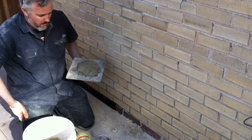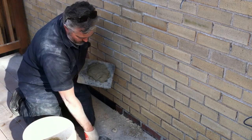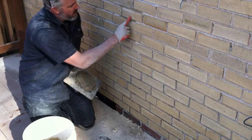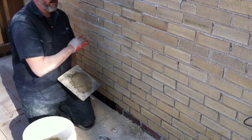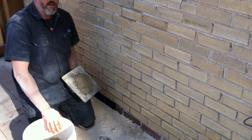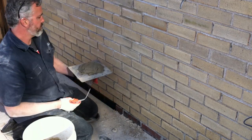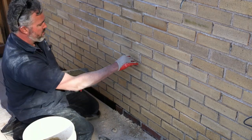I don't want to make a big mess on the brick that I have to spend a bunch of time cleaning. When I leave, there's just a little bit of film on these bricks — that's the most I want to leave with when I finish tuck pointing. That way when I come back to wash down, it wipes pretty much right off with water, maybe a little vinegar. Worst case you throw some muriatic acid and water and wash it with that.